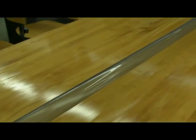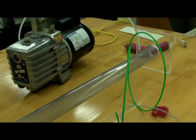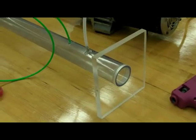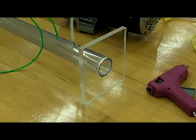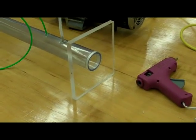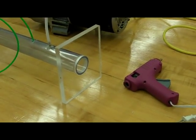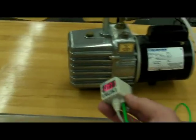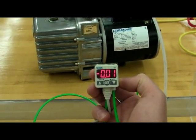I've got a clear tube here, bought from an industrial supply place, but typically people use white PVC tubing. Here's the breech - that's where the ball is going to go in. There's nothing different about the muzzle and breech; this thing doesn't care which way it shoots. So while it's pumped down, you never want to be in line with the barrel - if the tape fails, it could fire in either direction. There's the nice high vacuum pump, and I've got a gauge here that'll tell us what the pressure is.